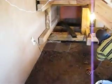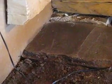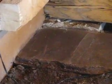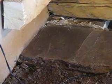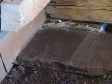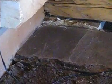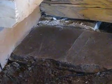We're doing the finishing — the finish part — which is a mixture of our adobe soil from this land we're on, one shovelful to half of mortar sand, and then half of another soil that has a little bit more clay in it. So it's one to half to half.